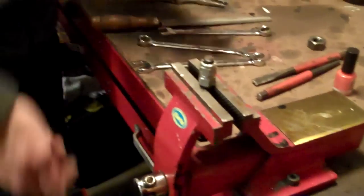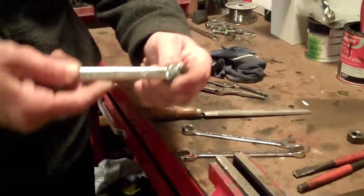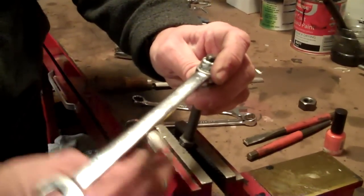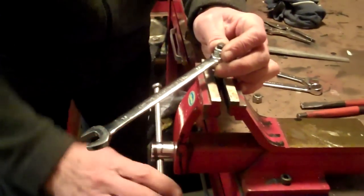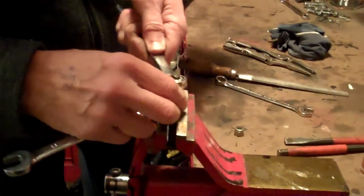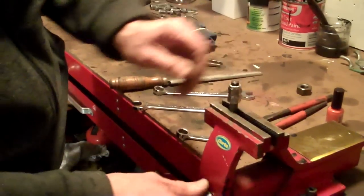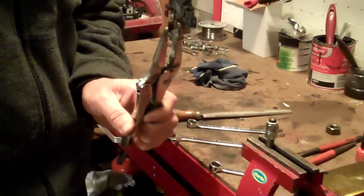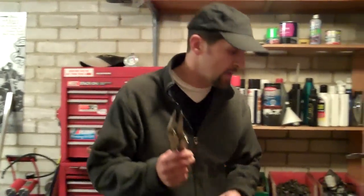We're going to presume you've done a proper job of completely screwing it up — or someone else has. We'll truly beast that fastener: all the corners are buggered and it's started to chew quite badly. At this point, the first thing most people do is make the cardinal sin of reaching for the grips. Truly, I can't stress this enough — that is the worst possible thing you can do.